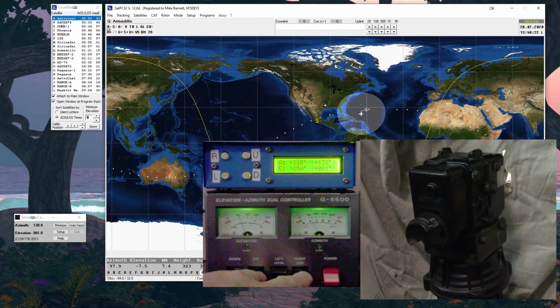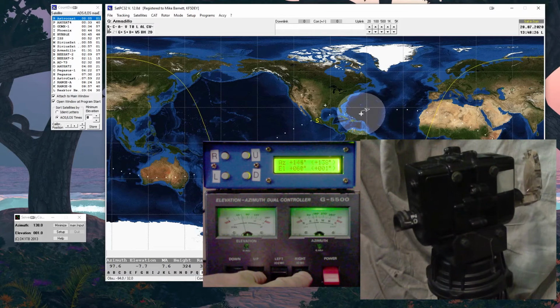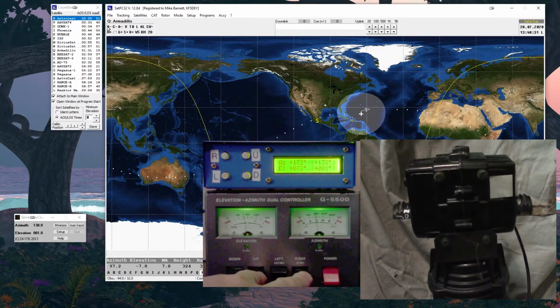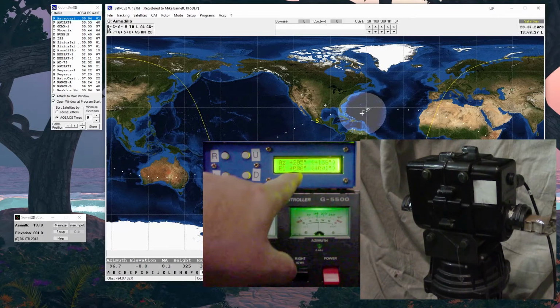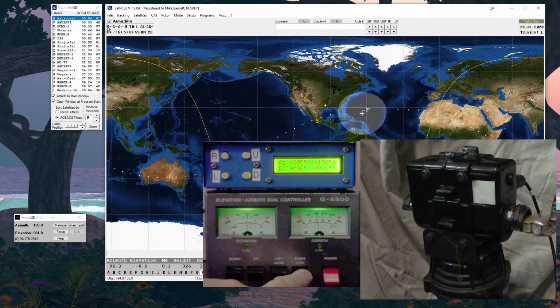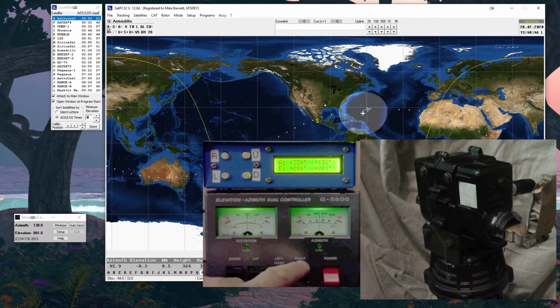You check at the full left position. You check at 90 degrees up, and in our case, 225. And why 225? Well, guess what? That's the halfway point. So about 90. It's pretty close to 90 on the thing, and not quite 225. And it just happens to have a mark right at 225. So this would be the second calibration point, showing your midpoint.